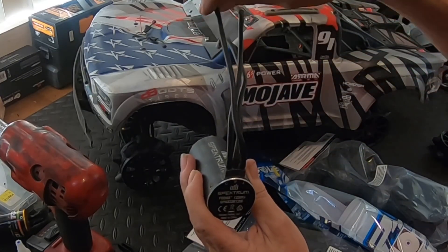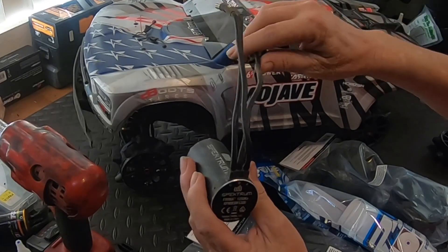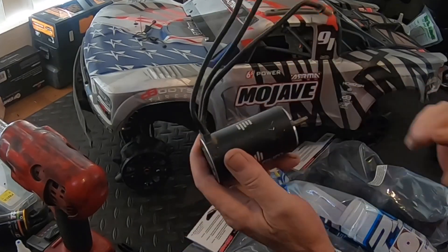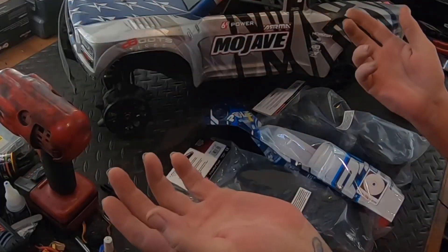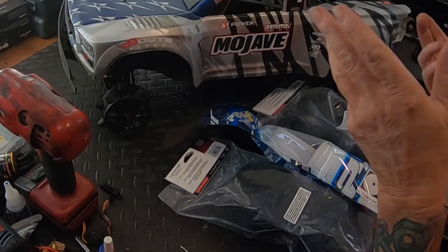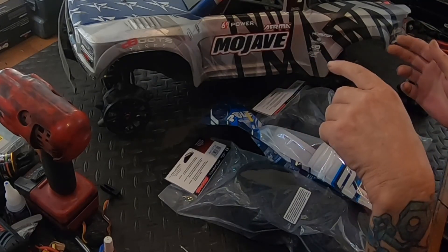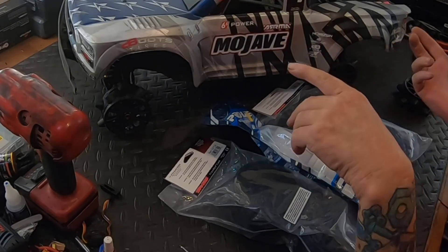So A was on A, C was on B, and B was on C. I ended up having to switch two wires to get the motor direction correct on this system. Well, once you go sensored, you can't switch the wires — it'll smoke some stuff, so you can't do that. I should have caught it. I didn't test it before I left. Turned out I had 100% in reverse, full throttle in reverse, and I had 50% forward, and then my brakes were backwards.